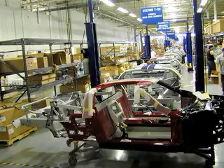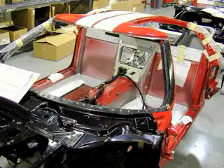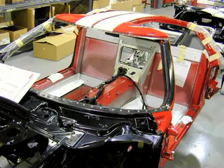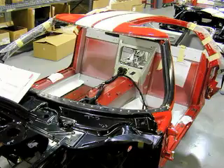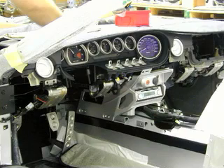This is the first in a total of 22 assembly stations. The doors are removed for a separate door build-up process and the sound deadening material is installed. This is also when the main wiring harness is installed along the frame tunnel. Additional wiring harnesses are then installed, along with the accelerator pedal and initial brake and steering system components. Multiple stations are used to install the steering and brake components because of the tight spaces involved — if all of these parts were installed at one station, the line workers would be constantly banging into each other.